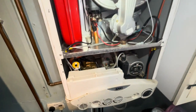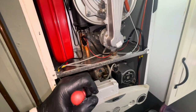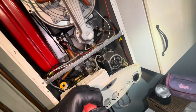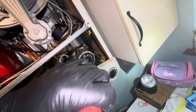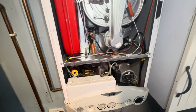Other common faults: the pressure sensor on the dual-tech is down there - it always leaks, always drips. Just take it out and put some PTFE around it. The thermistor always leaks. Diverter valves, depending on water quality, water can seep up into the cartridge and take that out. And the auto air vents leak. That's down to water quality.